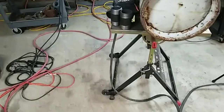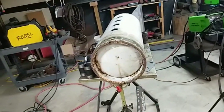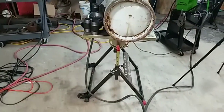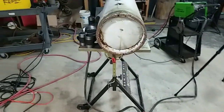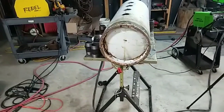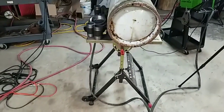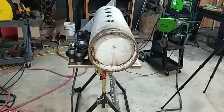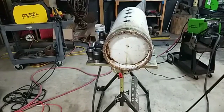Remember, just because I'm running four-inch out of this tank doesn't mean I'm using the full four-inch water supply — it goes to the spray bar on the trommel and is reduced down to a bunch of half-inch holes. People might wonder if there's enough pressure to force water through the two-inch ports, but with all the volume and pressure in this manifold, there will be plenty of water for everything. Like I said, I'll probably have to use that bypass to get rid of some water. We're going to continue on and get the bottom hole in.